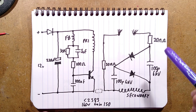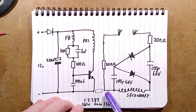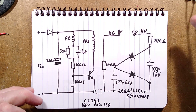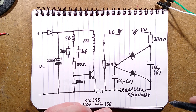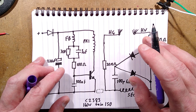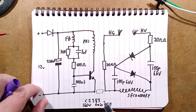It's a specialist area — high frequency oscillators like this. It couples across to the secondary winding, which is the high voltage, and across that you've got a basic little voltage multiplier. They called it HG, and the high voltage one is HV. That goes to the carbon fiber cluster emitters. One end of the coil goes straight there; the other goes through the step-up arrangement with the multiplier. There is a resistor position that would reference it to ground, but they haven't populated that — I wouldn't normally recommend adding it.